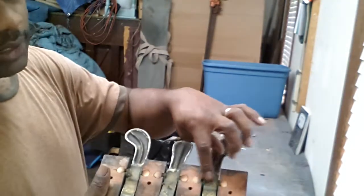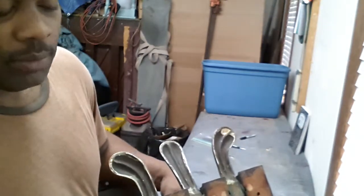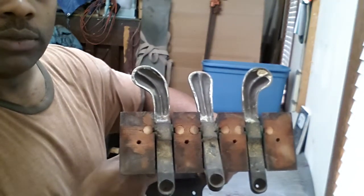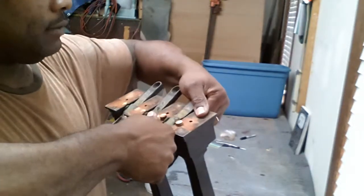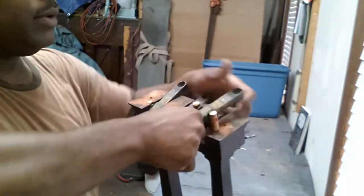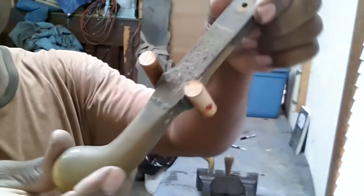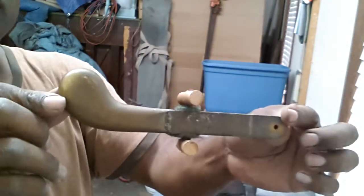Now, on the pedals, you can see here, and most companies use this style setup with the dowels on the pedals. Steinway has a system that's a little different. I'm going to be rebuilding a Model A coming up here soon, and I'll show you how their setup is. But they don't use wood on theirs. And there are a few manufacturers that don't. So I'm going to pull these out, just a gentle pull on it. It'll come right out, but that's basically what you have there on the pedal. That's the bottom. So it's basically it there. So I'm going to pull these out.